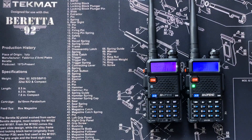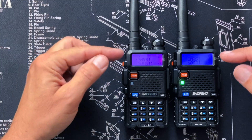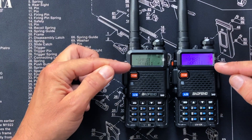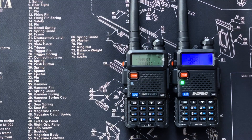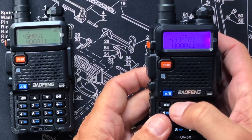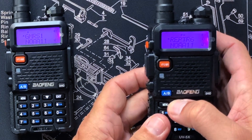Right out of the box, they turn on — they are on GMRS channel 1, and it looks like NOAA channel 11 on the lower frequency. As with the UV-5R, you can listen to two frequencies at the same time: GMRS channel 1 at the top, NOAA channel 11 for weather on the bottom. One thing I misspoke about previously — I said it only had four repeater channels, but scrolling through, after GMRS channel 22, we've got repeater 1 through 8: eight repeater channels. The previous version also had eight. That was my mistake — my apology, Mr. Baofeng.